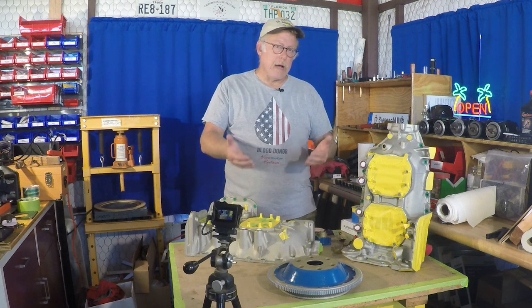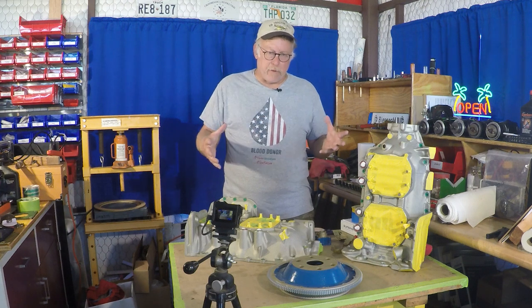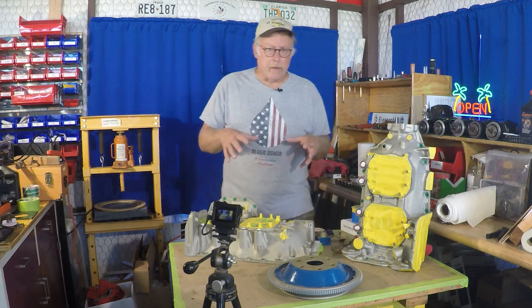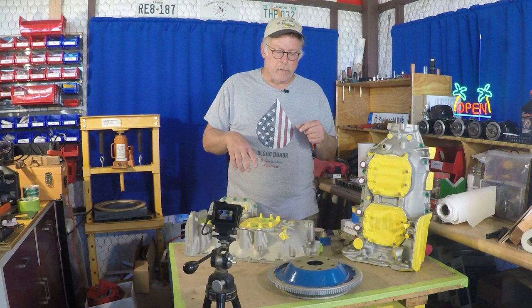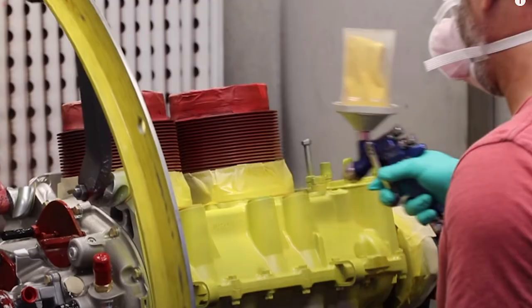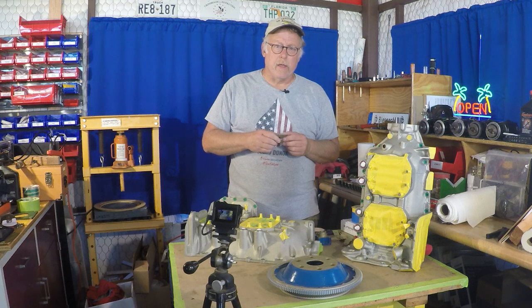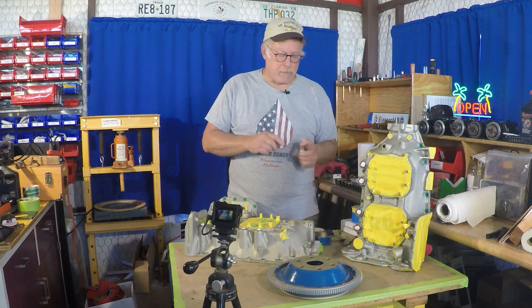On this particular build we're buying four brand new cylinders so they don't need to be repainted. They don't need to be cleaned up, so that kind of forces us to paint it as components. The problem with painting everything assembled is when paint gets a little time and temperature on it, the paint will start falling off the cad plated parts because cad is inherently, as far as paint is concerned, kind of slippery — it doesn't like to stick well.